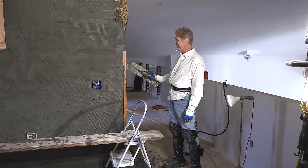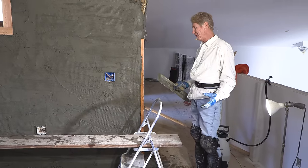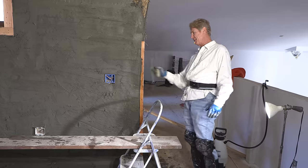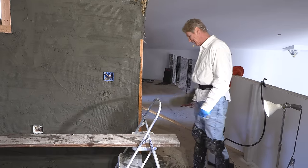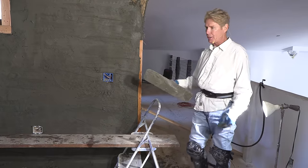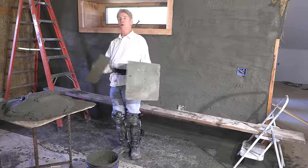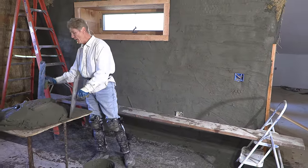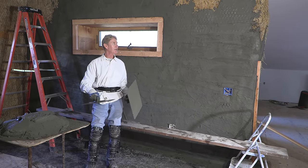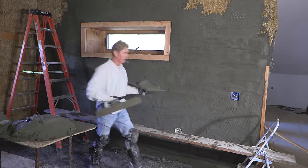Here's an old plastering trick. How come nine inches won't adhere or float or defy gravity? Because it doesn't do that. There's no corner aid here because we're rounding these off. So I put this piece of wood here, screwed it in, and let the wall set for an hour. Hopefully when I pull that, it will hold that nine inches in a corner — nine inches of plaster or stucco. It'll do so much, but it won't defy gravity. We're going to see what that looks like after lunch.